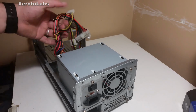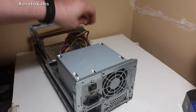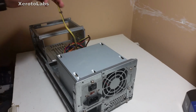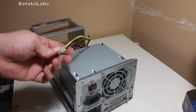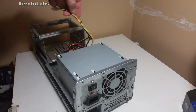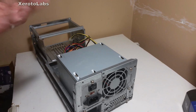Then of course I'm going to do the ATX to benchtop power supply mod on this, and I'm probably going to leave the CPU wire because according to the side of the case, this has its own 12 amp supply, which seems a bit hard to believe with only those 4 little wires. So the main 12 volt rail is 12 amps. This is supposedly up to 12 amps, and as usual, the 5 and the 3 volt rail are considerably stronger.